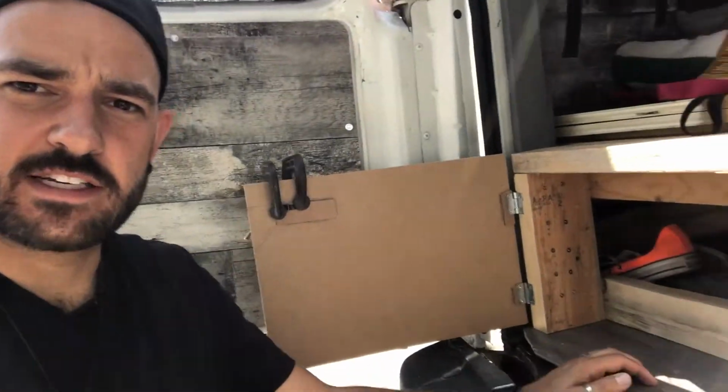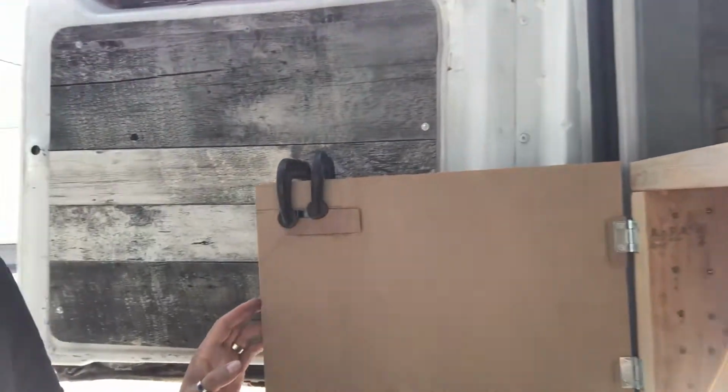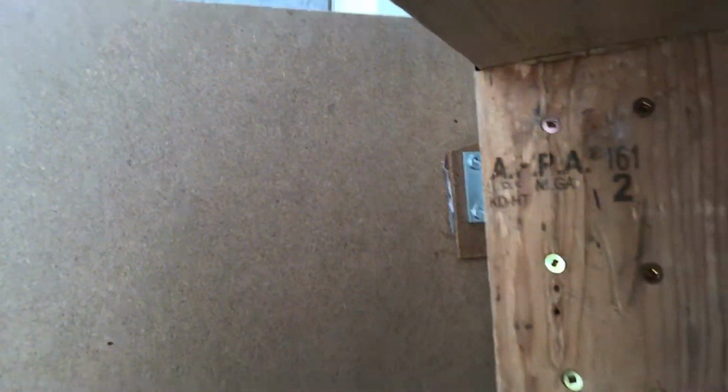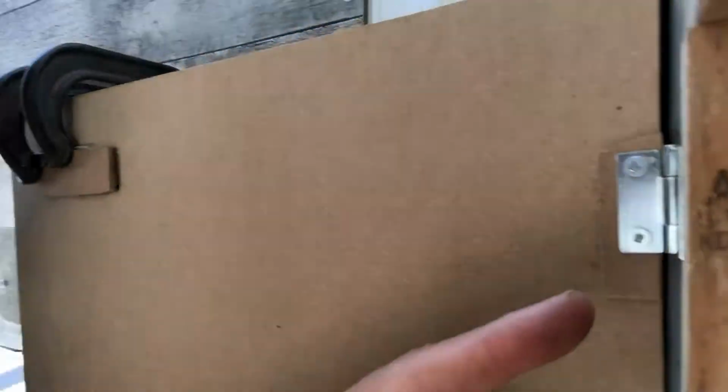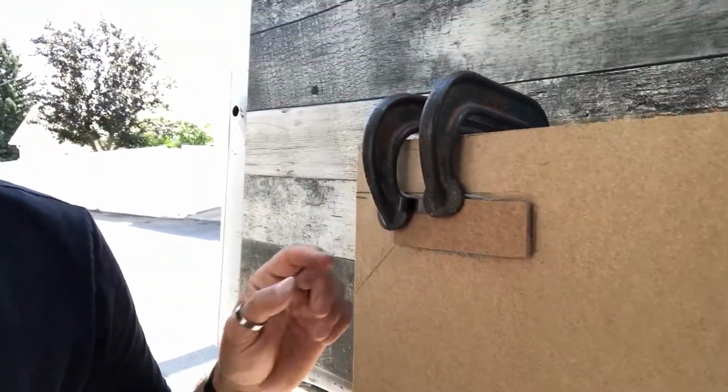And I just wanted this clip to show the door done, but unfortunately ran into some snags. So got it on here, right? Got some hinges. Because this board is so thin, I had to make little adjustments. Right, that's the easiest way to show you. There, right? It's just a piece of the subfloor on the hinge to make it thick enough so that the screws don't come through the MDF board, right? And then the same thing was happening over here.